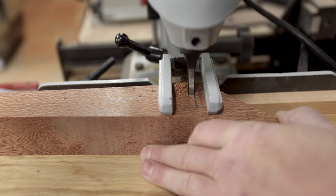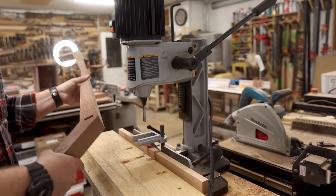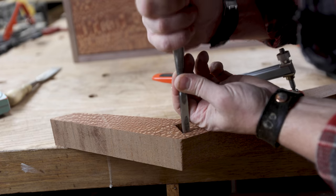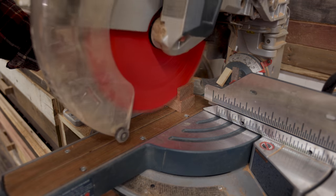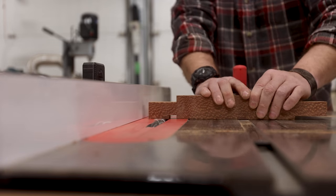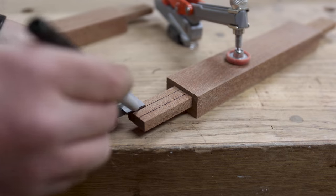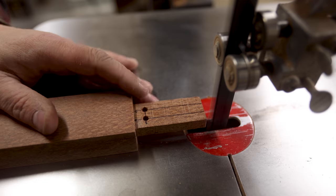And since there are two sets of legs, I wanted to connect them using a wedged mortise and tenon stretcher. So a wedged mortise and tenon is a fairly simple thing to make, but it looks very intimidating, so a lot of people tend to stay away from them. You actually don't need to get everything perfectly tight, you just want the sides to be a good fit.